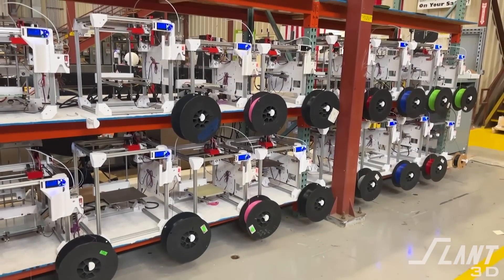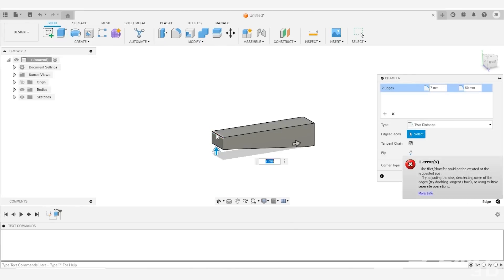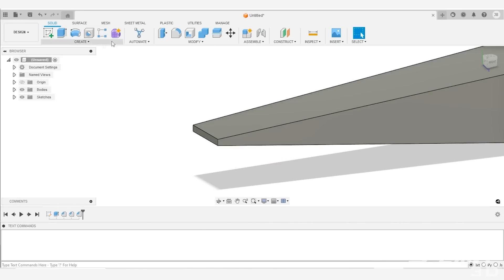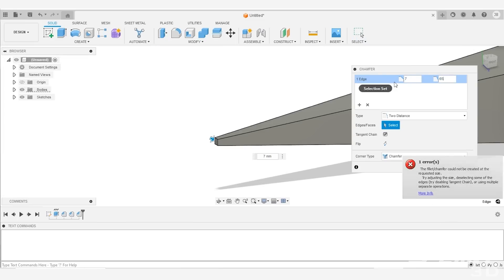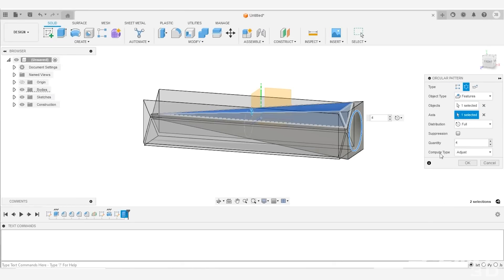But what if the golf tee or a similar object was being invented and manufactured today? Would you actually be able to mass-produce something as simple as this with 3D printing? With 3D printing you want to maximize surface area — as much strength in the skin of the part as possible, which means you want something fat. But it is a stake that has to go into the ground, so it has to be very easy to press in — you can't have a large cross-sectional area; a railroad-spike-sized stake just doesn't work.